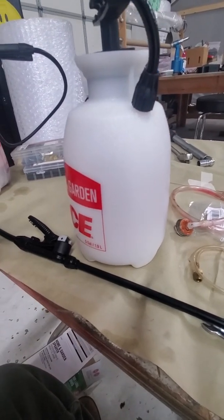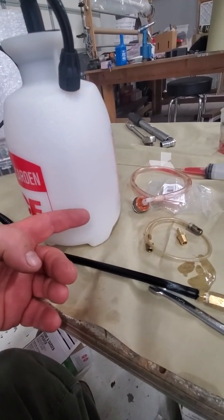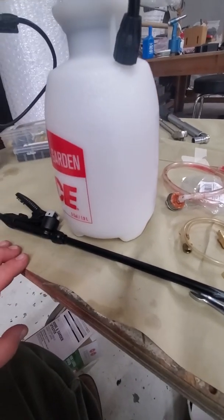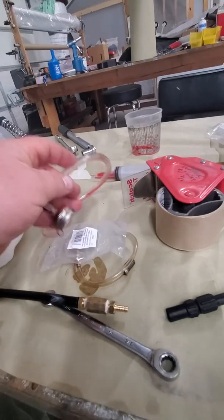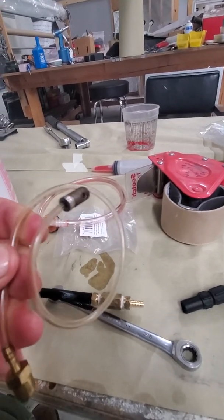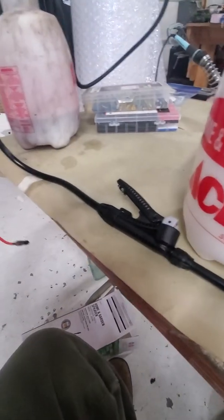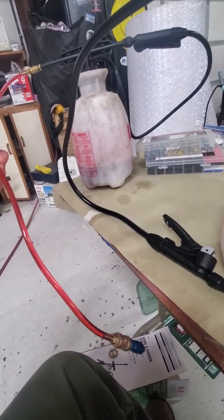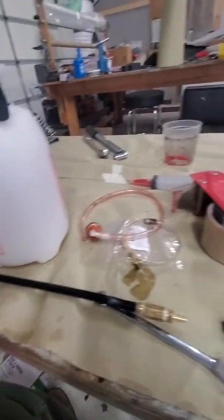Hope you enjoyed this video and it helps you out. It's super simple and self-contained — keep your 5606 in it and whenever you need to service your brakes again, it's ready to go. The only drawback is that clear vinyl tubing gets stiff and brittle with age and use, so you'll need to replace it occasionally — but it's only about 10 to 20 cents a foot. You can see the bubbles and work them all out. Give me a thumbs up if you liked this — thanks for watching!